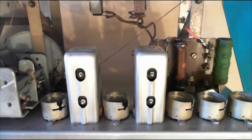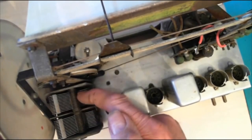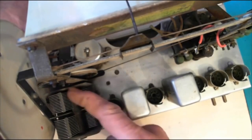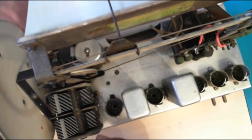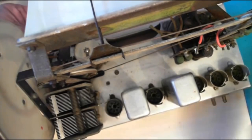Here's the first clip — this is where we're looking around a chassis. This is the Bush DAC 90A radio chassis. In the video about reading circuit diagrams I mentioned various bits and pieces such as the variable tuning capacitor. This is two variable capacitors on one shaft. When you turn that, these aluminium vanes mesh with the static vanes here, or unmesh, so that increases or decreases the capacity. You've got oscillator and aerial sections on there.